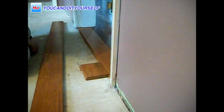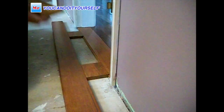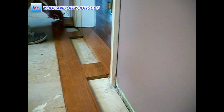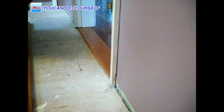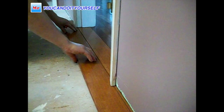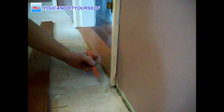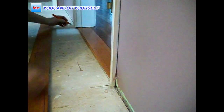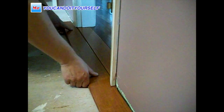The new floor is a little wider. I already installed a board under the door trim, then I put two small pieces on a long board to mark how much I have to cut off — very easy, remember this trick. I check it and then make two perpendicular lines on the long board to make the cuts, because when you cut it you don't want to see any gap between the trim and the board. Now it fits very well.